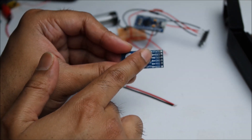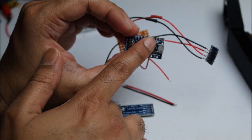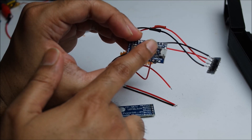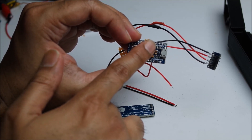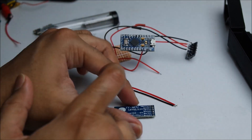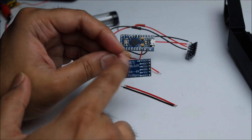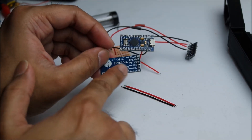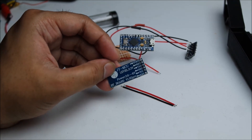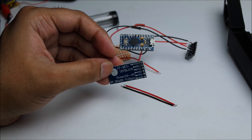So we'll connect the receiver to the Arduino's transmitter pin which is over here. And the one next to it is the receiver, which will connect to the transmitter on the Bluetooth — so you understand the flow. This transmits, that receives; that transmits, this receives. So we'll connect it that way around. You don't connect TXD with TXD.